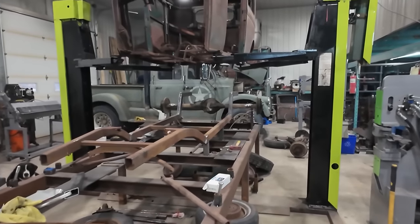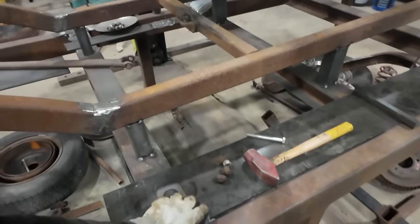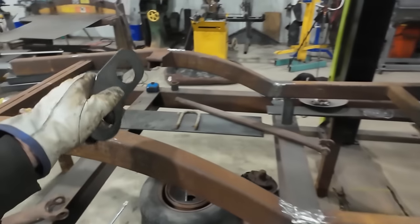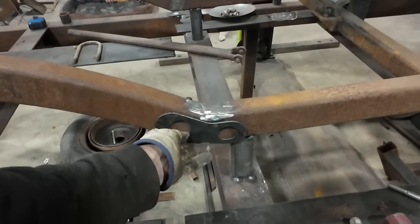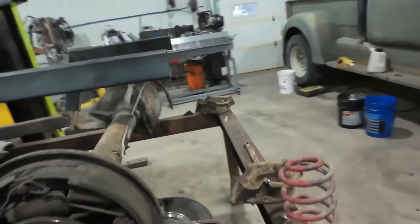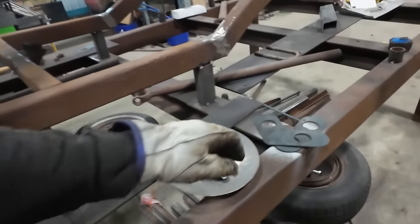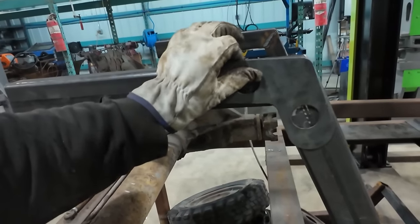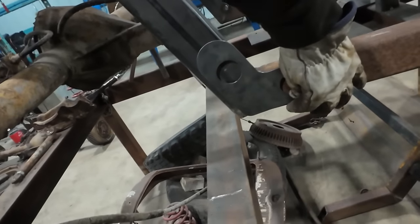Wally was out working on his car here, so he basically got all the welds all ground down. I don't have any good 3/16 plate to do anything, so I basically cut up some templates for gussets we're gonna do. I just did these out of some spare 16 that I had over there. The idea is we're sticking these boxing plates on everywhere, so we got there, and I made something else for the step-ups over on this side. So he kind of cut free his spring pockets. We're going to reuse those. And then I did these, which I downsized just a hair, but they're going to go up around here, get welded and then fully welded all around on all the different angles. That's the plan.